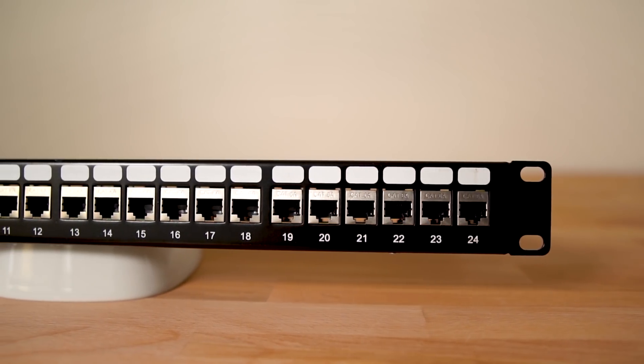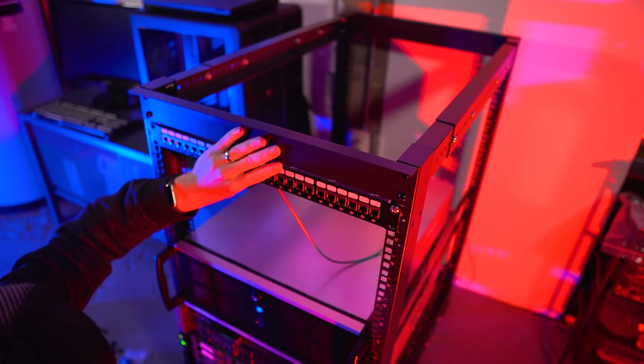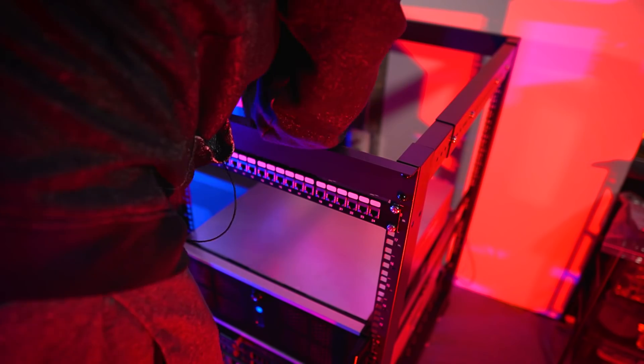This gives me a ton of flexibility, but at the cost of buying a few more ethernet cables. But when's the last time you said to yourself, 'I have too many ethernet cables?' The nice thing about keystones is they can be swapped out for things like DAC, fiber, or even HDMI. It was also pretty simple to install — you just line it up, screw it in, and connect your ground wire. The one thing I wish is that they made a half U version; that would allow me to install two in my rack and take up only 1U total, which would help clean up the cables in the front.